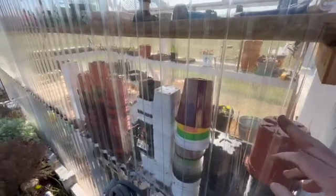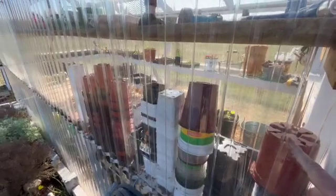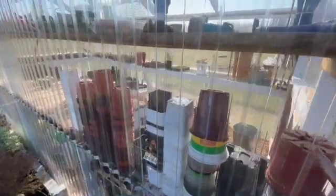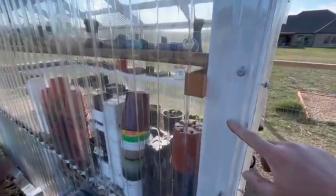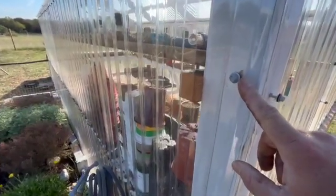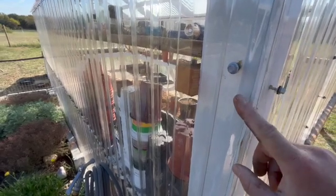And then these panels are really good panels. I got the more expensive ones from Home Depot. They're made in Israel. I don't know why that matters, but I said it. Maybe they're kosher. And when you put these panels on, I learned that you have to drill a hole first in the panel and then put your screw in, because these panels will shrink or contract, and if you just screw it in there, I guess it can crack.